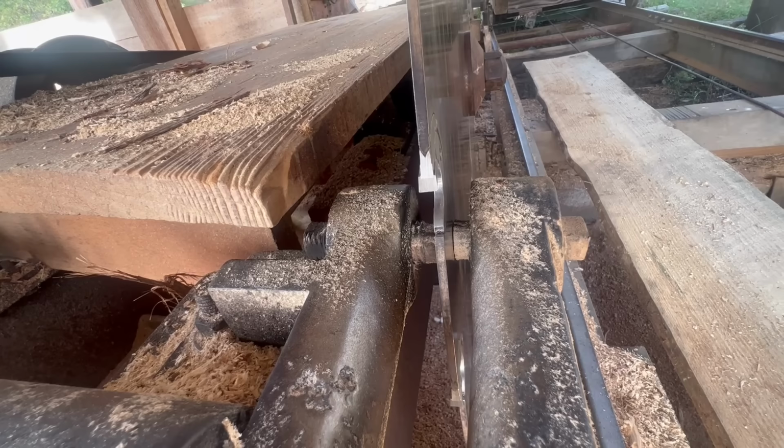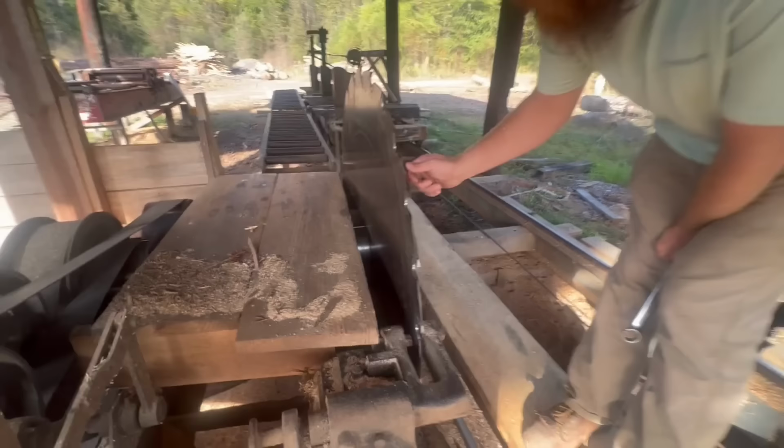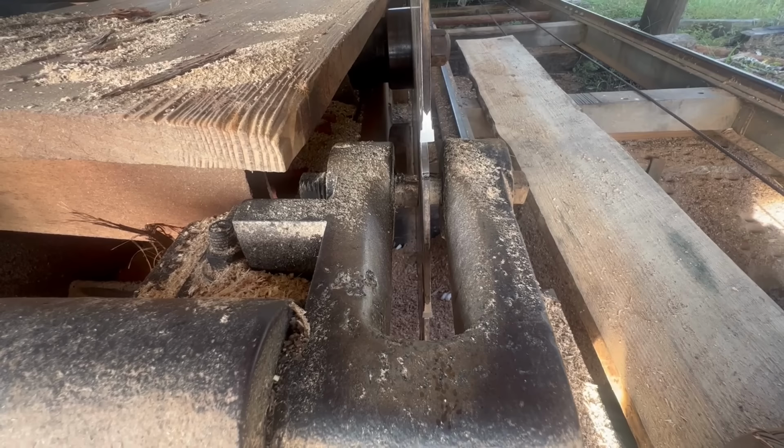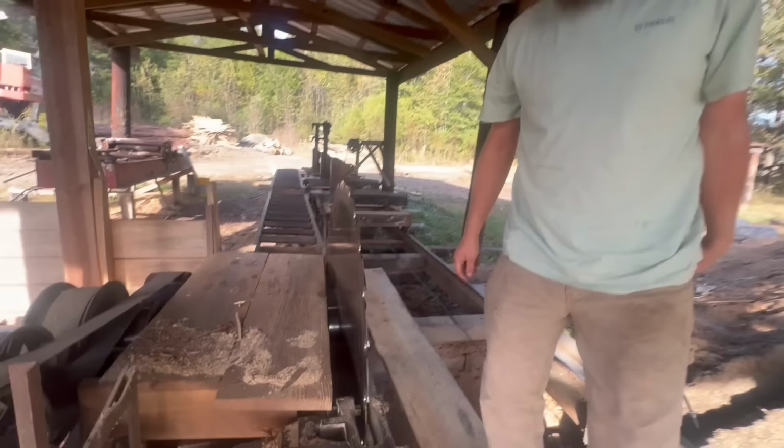When you hear somebody say, I need that saw to stand up, what they're talking about is, under its operating speed, it opens up and runs between those two guides. And you can clearly see this saw is doing just that, because under operating speed, I adjusted it to where it barely touched on either side. And when it goes off, it's back out here on this board, log side pin. So, success. Don't have a collar issue.